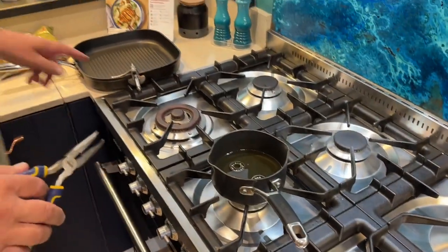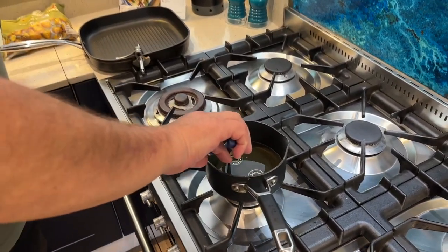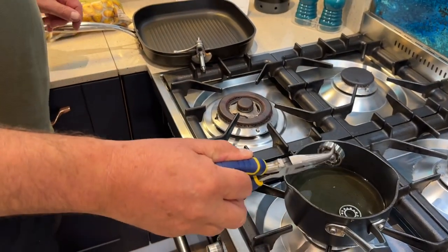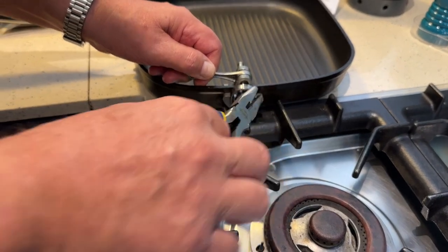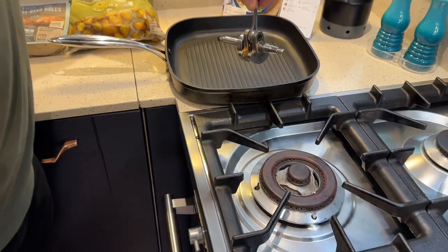We've been on here about 15 minutes now, and I've put the shaft over in the corner. We're going to try picking the bearing up with a pair of needle-nose pliers — hopefully at about 140 degrees. The idea is we come across and just slide it on there. Oh, look at that — it's gone straight on! That is amazing. No hammering, no nothing.